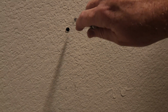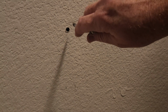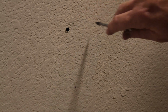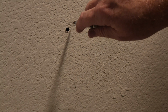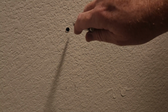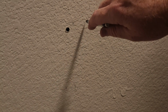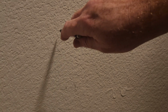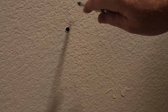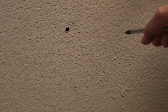What I could tell was that the pipe looks like it's a copper connection. It must transition to PEX going out, or it's a reddish PEX. Hard to say, but it's coming from this direction here, and has 90 degree elbows, and goes out the wall on the exterior. So I don't want to come over here and start cutting too much, because that's where the water line is. I can definitely cut more freely on this side to start, and work my way over, being real careful, and then open it up.